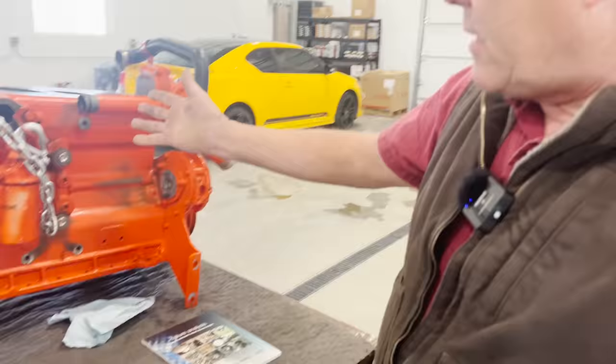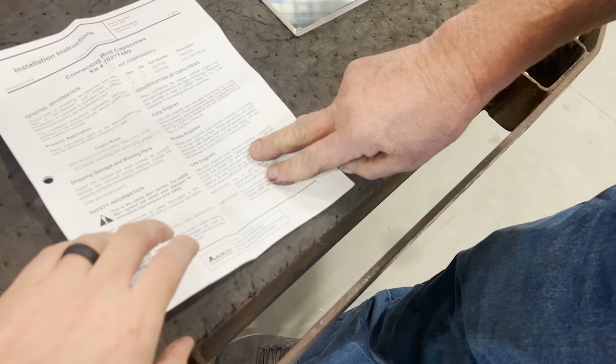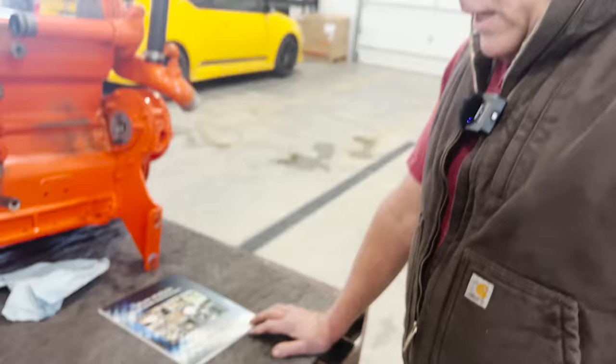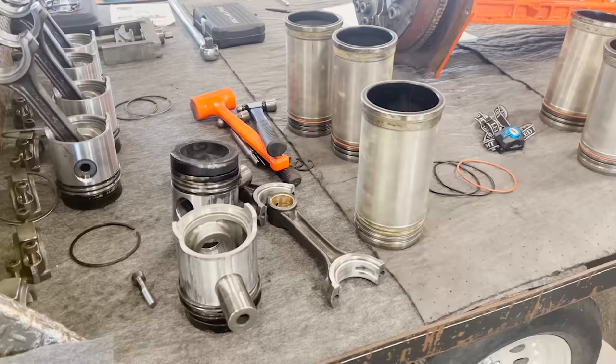This particular engine — we haven't seen a lot of these motors, but now having two at the same time reveals the differences over the years. It appears there's an early, middle, and late series as far as connecting rod bolts go. Our engine falls into the middle series, which uses socket head cap screws as grade 100 rod bolts, and those are not required to be replaced. The first time this engine was overhauled, the bolts were reused — there was no distress of any kind in the bearings, and it was probably the first time the engine had ever been apart.